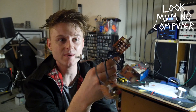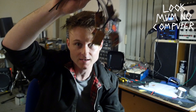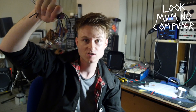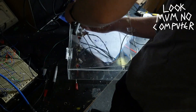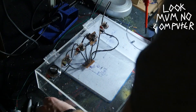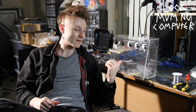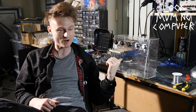You can literally build these in like five or ten minutes each. So what if we put together a couple more and popped them in a box and let them all mangle together and just be little drones? In around 20 minutes I've got them all soldered together — that's five oscillators in my hand. We just need to put these in a box, solder the jacks together, and yeah, should be done.